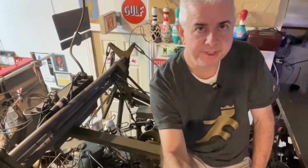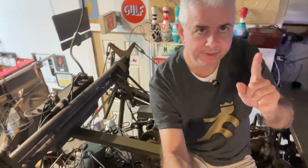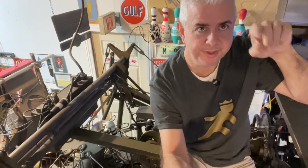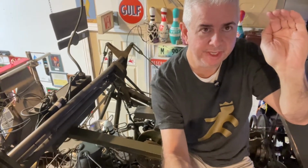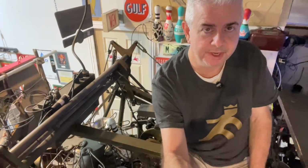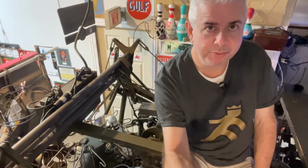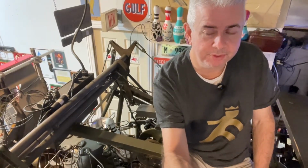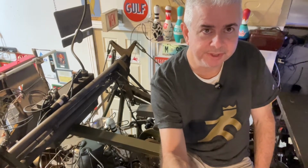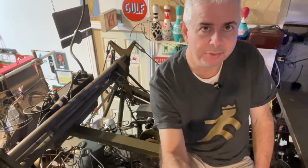Let's see, if you ever have a deck jam, that switch that you saw in that slot there has a little pin through the very top with a little rounded backing on it, which is up against the switch. So if that's ever pulled down, your machine shuts off. There's several reasons why a machine would black out. Now let's go over a few of them, and maybe you can identify what's malfunctioning on your pin setter as to where the pins are when you find a blackout.